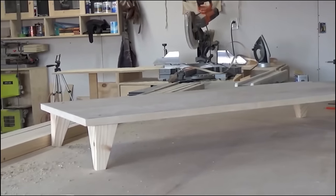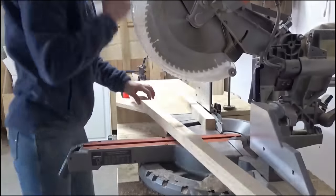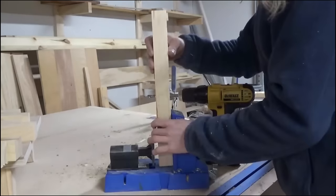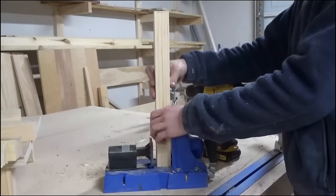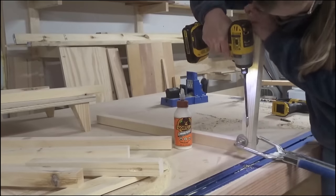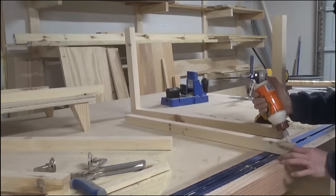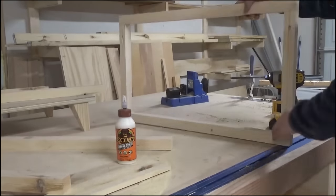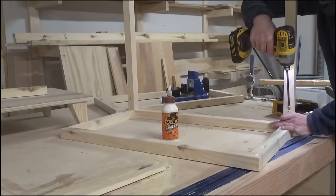Now that the base was assembled I started building the frame to go on top. I made the frame from 2x2s and assembled it using my Kreg pocket hole jig with pocket holes and screws. I haven't had a lot of luck using two screws on pocket holes on 2x2s and 1x2s — my wood likes to crack if I get too close to the corner. So I usually drill only one pocket hole on the ends of these pieces instead of two, and add some glue to help hold it in place. You can find all the measurements and plans for this build in the link below.